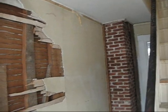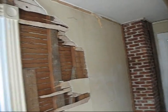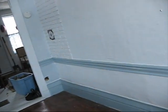I'm not going to attempt to take the whole wall down today, but I'm going to attempt to get all of the plaster and all of the lath out of it. I've got it where I can close that door, I can close this door, and I've moved everything away from the wall on this side. I've got all the furniture set away from the wall, took all the pictures down. I'm going to run a sheet along the ceiling to try to keep the dust from the lath from getting all in the furniture here.